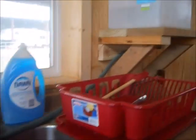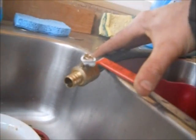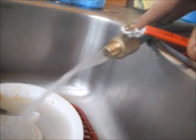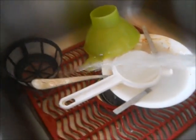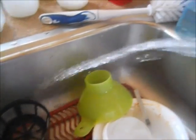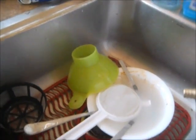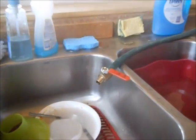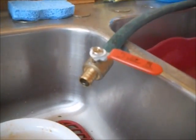You need a full opening to get any kind of flow with such a small drop. So I found this water valve — it's basically the full diameter of the water hose. You can use one hand to turn it on, and at about three quarters open you can get it to spray across the entire sink. If you need more, you turn it on full flow — of course I'm wasting a lot of water right there, but you can see how it works.